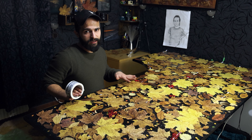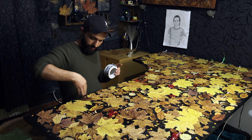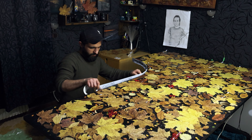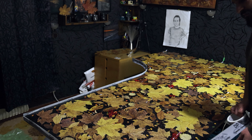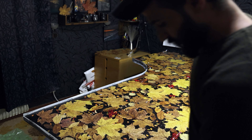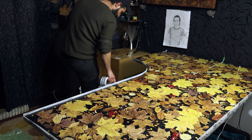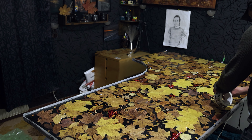After gluing all the leaves on the table, I start to tape the corners and do the epoxy. I found that this tape is not working. There is a special cover that you can use for all these edges — so don't use tape as I did, because at the end you will have leaking and the edges will not look perfect. You can buy a soft plastic cover, cut it, and cover the edges of the table. It takes time, but it will look better.